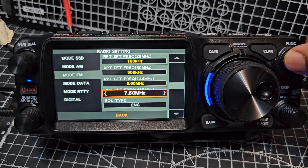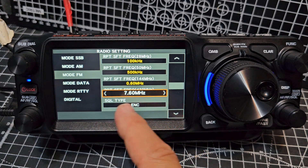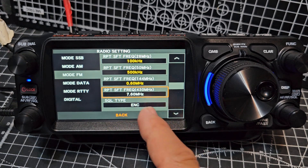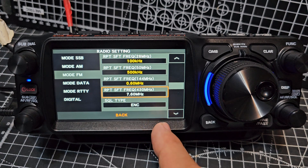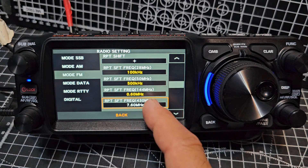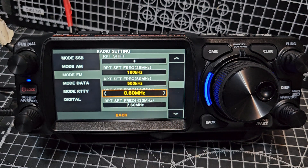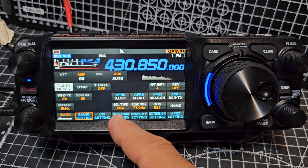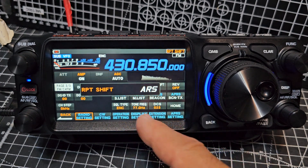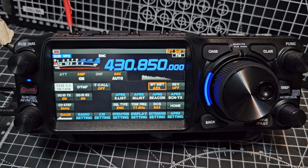The shift amount — you can just select it and then turn the function knob, or use the arrows. You can also select encode, your tone, squelch or tone. There's automatic repeater shift, which will do the plus and the minus automatically. But otherwise, just keep going — on this repeater I need a plus shift. It's simplex — see that? It just changes and shows it. Plus. When it shows it, that's what's been set.